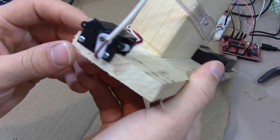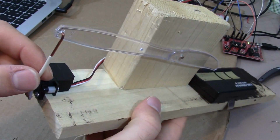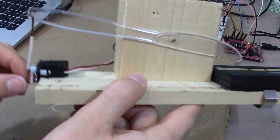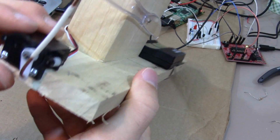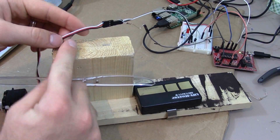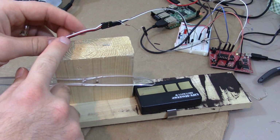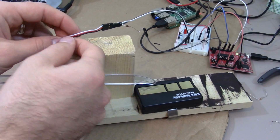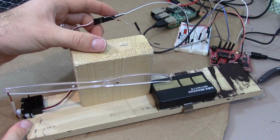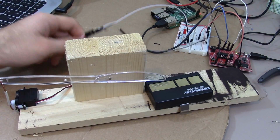And then we have our servo motor down here screwed into the board, and for this I just used a thick copper wire you could find lying around, then bent the edges and plugged them into the holes. And this is a servo motor you can find, goes up and down like that. So then for the wiring, of course we've got ground and 5 volts, or is it 3.3? Yeah, it's actually 3.3 volts going through the MOSFET, and then we have signal right here, which essentially tells the servo where to be. And then you have a resistor going from signal to my MSP430 microcontroller.